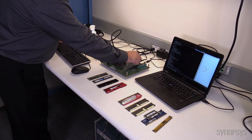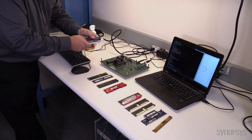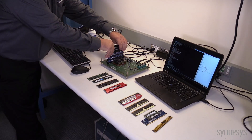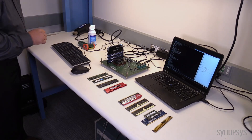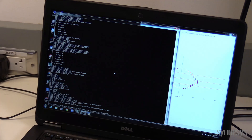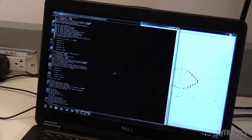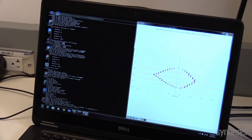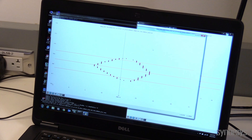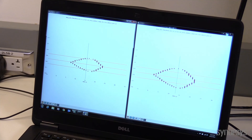Now I'm going to make the environment a little more difficult to operate in. I'll take my channel quality and drop it down by sticking in three DIMM risers in the middle of the channel just for fun. There's going to be a reflection at the 90-degree turn on the PCB and at every one of those sockets all the way up to the DIMM — less than ideal. But because of the way the PHY handles everything, it can still find a data eye to train and run at, assuming one exists. And that's still a pretty nice data eye — I've still got a large number of tap points and a good minus 10% on my VREF voltage.